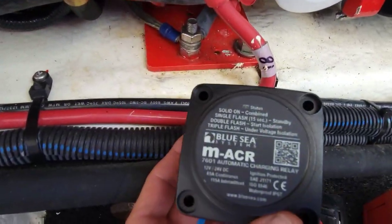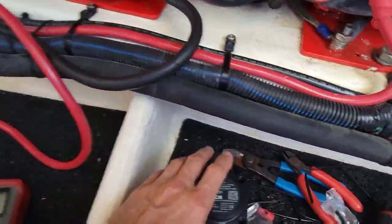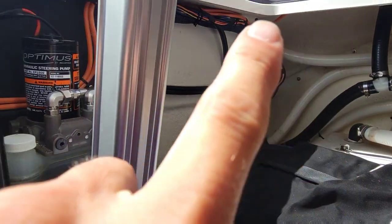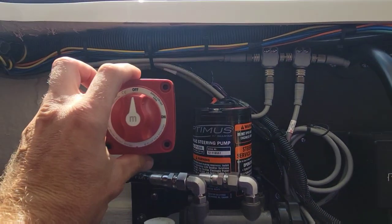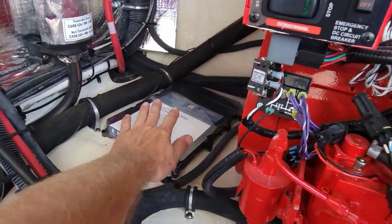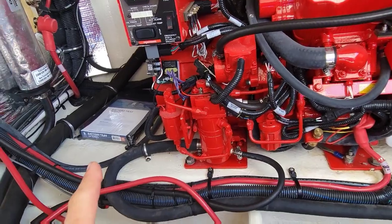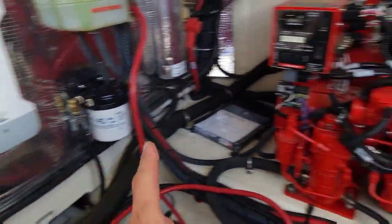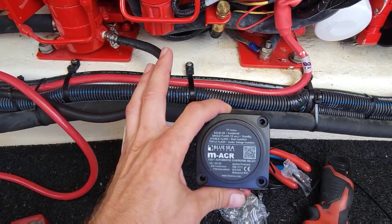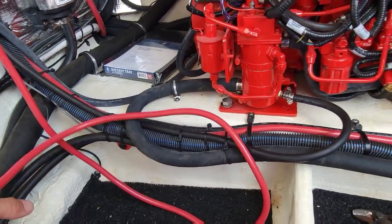Our best bet is to put an ACR - an automatic charge relay - in here. What it'll do is charge our battery but it won't back-feed. I'm going to hook it to our engine battery, either port or starboard. I'll put the ACR up here and add a battery switch over here so the customer can just reach in and turn it on and off. Then we'll run our wires down to our battery tray. The reason for this is: when the motor is running it will also charge our generator battery. Or if you turn on the shore power charger, that will also charge the battery. But it won't pull anything backwards - this will isolate it so it only charges and won't allow anything to be pulled from this battery. The generator will be isolated from everything else.